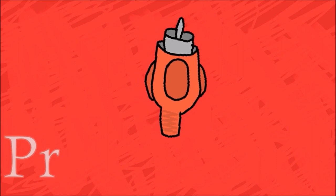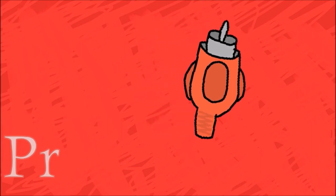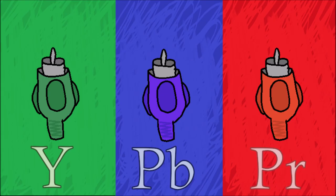Plugging in just the Pb and or Pr cable will cause the TV to not detect any image due to a missing sync signal. Swapping the cables around will sort of invert a bunch of the colors, except for green, because the green information is inferred by what is left over from the Pb, Pr, and Y lines.